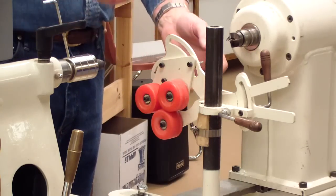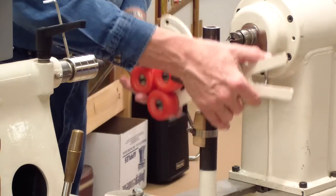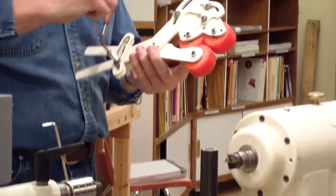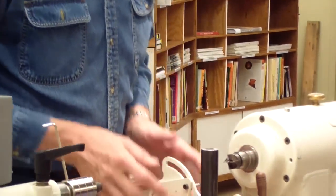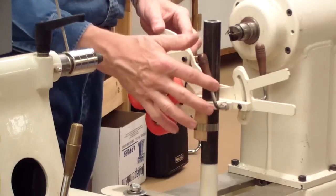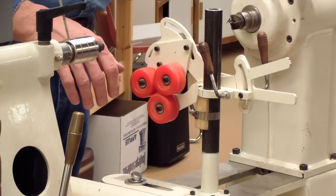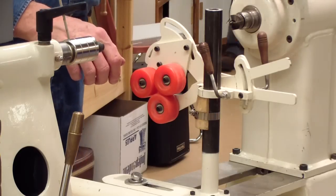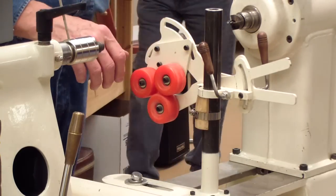Surface treatment. This thing comes with all of these daggone sharp wing nuts. And if you use this very much, it just eats up your fingers. So get rid of them. It'll cost you about $6. You need two 1/4-20 bolts, two 1/4-20 threaded rod connectors. Actually, I've only got one. I only need one rod connector. One washer, and that's about it.